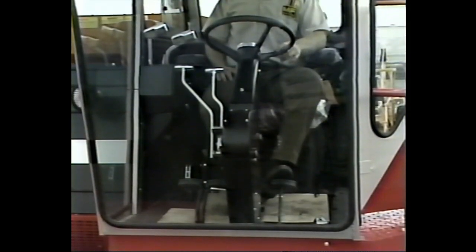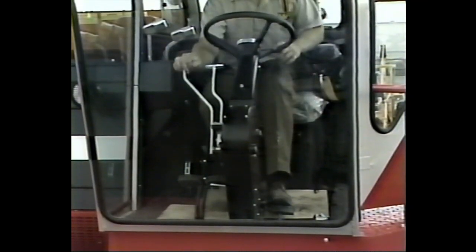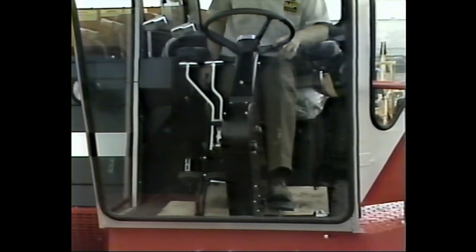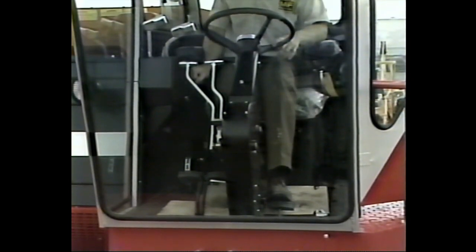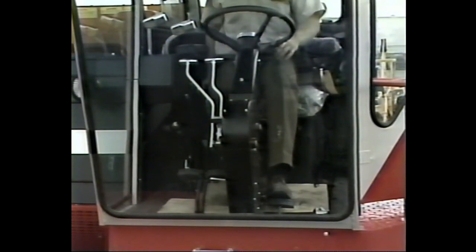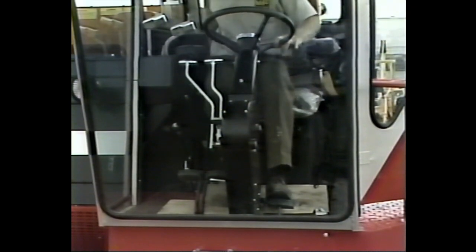Cylinder and fan speed settings are critical to proper combine performance, so you want to make sure these components are set precisely. To check and adjust the cylinder's low and high speed settings on the MF-550, 750, and 760, place the transmission in neutral. Start the combine's engine and engage the drives. Now, set the cylinder speed on extreme slow and let the combine run for approximately 30 seconds.